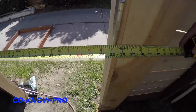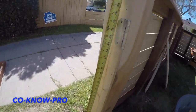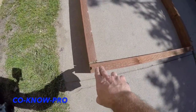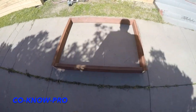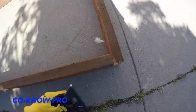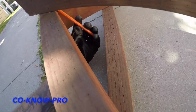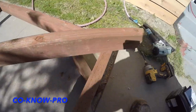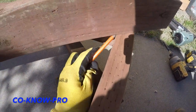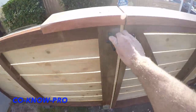Here's a gate for the fence. I basically make a frame, put a 45-degree support in the middle of it, then run the fence planks on that. A clearer dedicated gate video is coming soon, but basically: get four boards, screw them together into a square, set a piece of 2x4 diagonally in the middle making sure it supports from the hinge side up to the latch side.